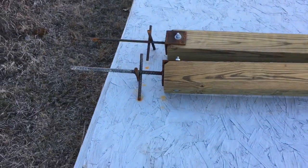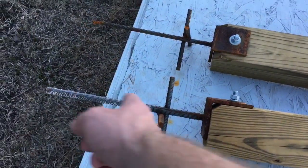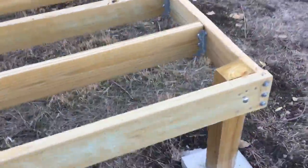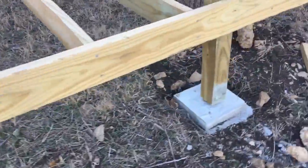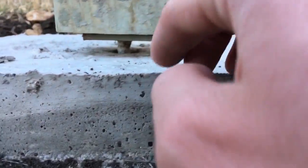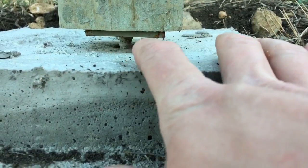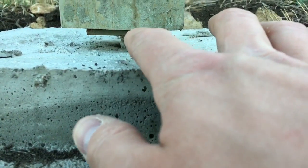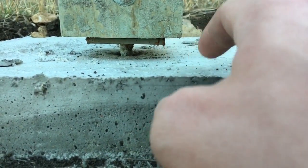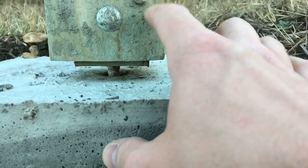That allowed for a minimum of about 12 inches of concrete holding it down. I'll show you what the post in the front looks like — that's what it looks like here. I didn't want the concrete coming up and over the post. If this post ever rots out, I can replace it via the half-inch rebar. I didn't want to put this in the ground and have it be washed away with water over time, with dry rot and everything.